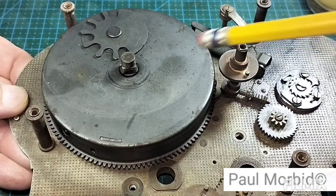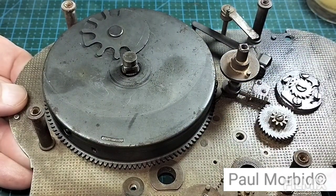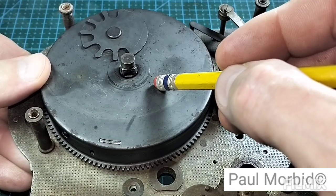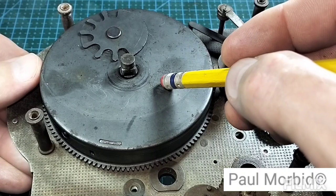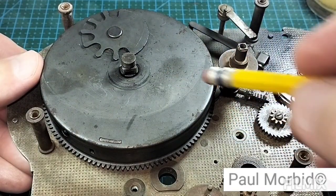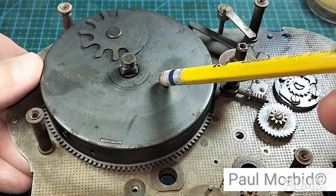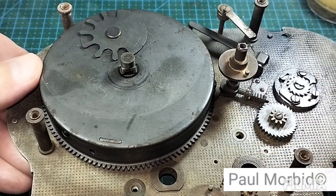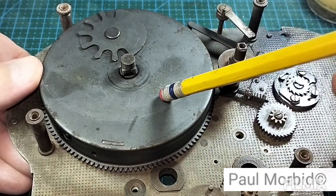Don't force the camera any further because you're putting pressure on this motor with a spring inside of it. It could snap. You know, there are times when the issue is the motor, just because the lubricants inside need to be replaced and the clutch barrel motor cleaned inside. The spring needs to be checked for cracks, damage, rust, corrosion, that type of thing. Although that's kind of rare, that's what needs to be done. Definitely the graphite grease needs to be replaced, and inside of here cleaned. And then the clutch under here needs to be cleaned just as we're doing now. But you don't need to dismantle this. Send it to a service technician for repair.